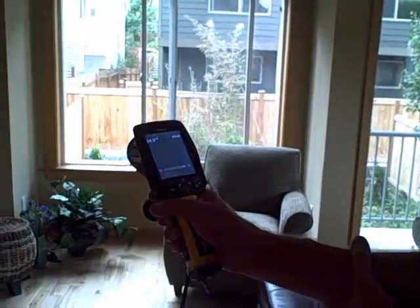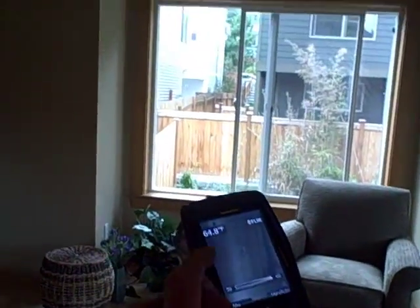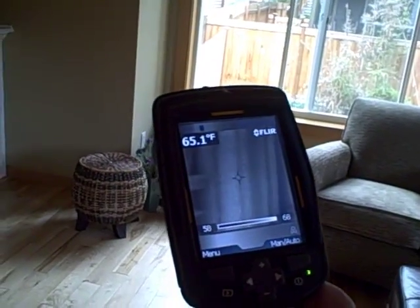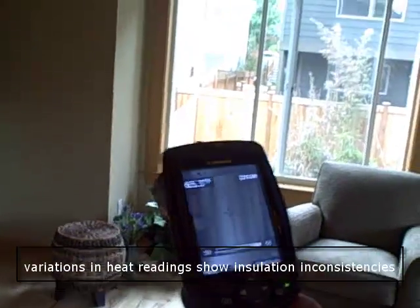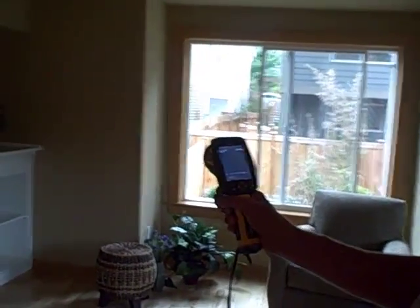Okay, Jeff, tell me how this thing works. So this is a thermography camera and it's detecting a heat differential. Right now we're looking at the framing in the wall right there. The temperature on the upper left is the center of that circle. If you have moisture issues, it usually shows up as a darker area, a colder area. It's also good for looking at insulation voids. We'll go upstairs and look at that, and we'll go downstairs and show you the infrared heating in the floor too.